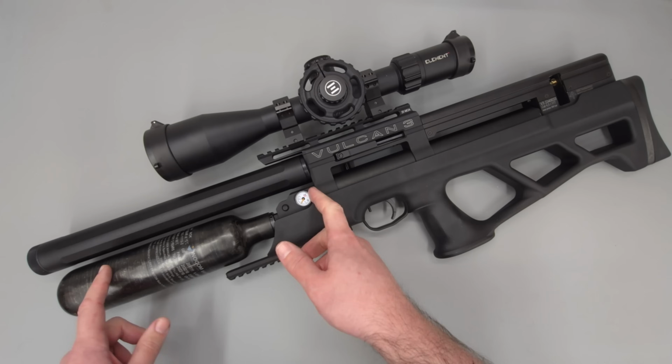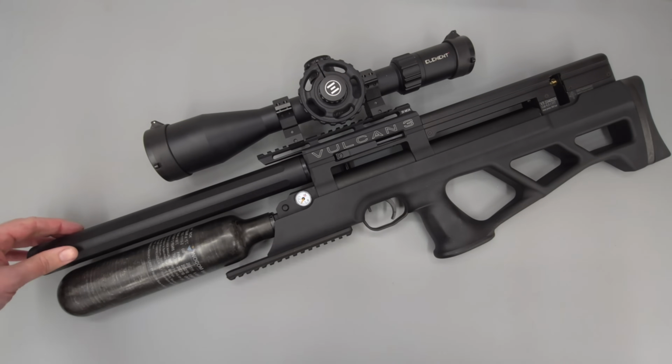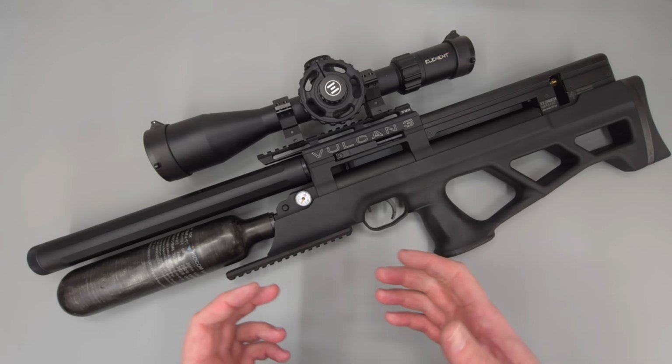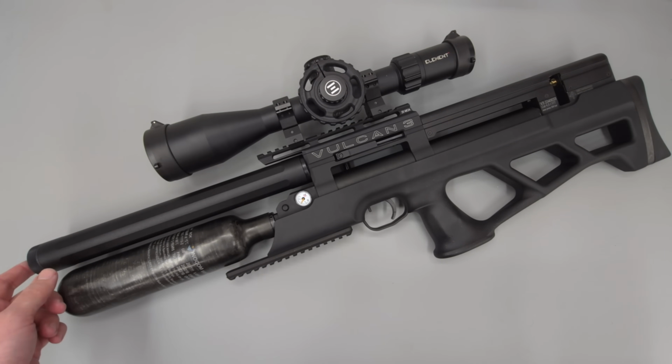With that said, onto this video, and we're going to be making a new shroud. To be honest with you, I really like the factory outside shroud here, so we're actually going to be keeping this piece and making a new inner core. The inner core will be a little quieter and also have a 1/2 inch UNF on the end instead of the factory M14 by 1.25.